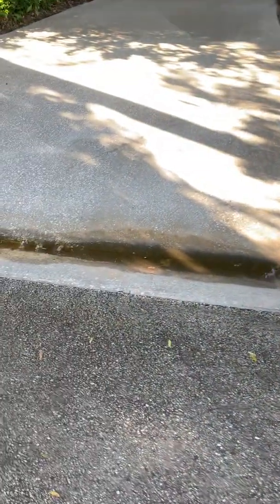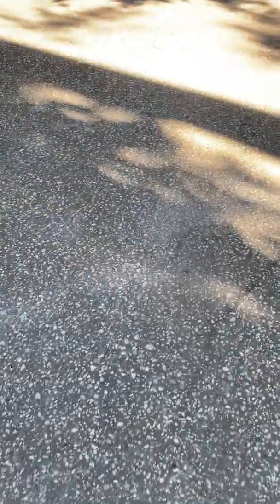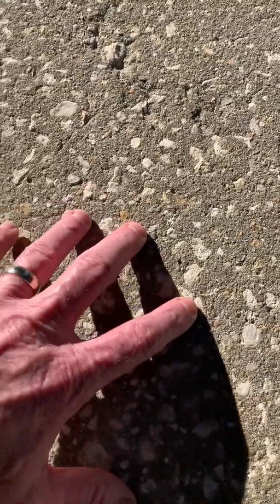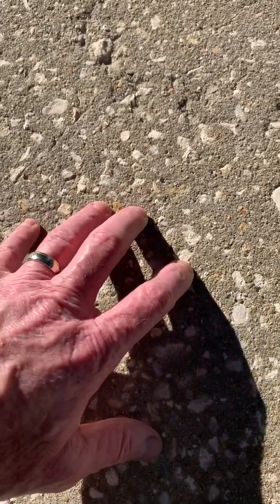of water down there. But as you can see, guys, this driveway came out absolutely spectacularly. Now, there are some areas where I'm going to need to rinse, where the sand is built up, and you may be able to see those. That is the driveway. It looks like I'm seeing some black here, but only in the video. This is beautiful concrete color right here. What you see here is just absolutely spectacular. Really, really beautiful. There's not a mark or shading on this whatsoever. We used a 12% sodium hypochlorite with an ANH oxy-based solution.